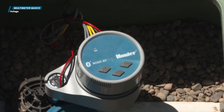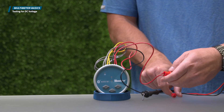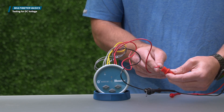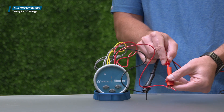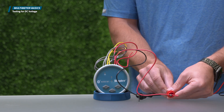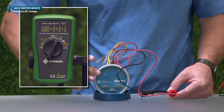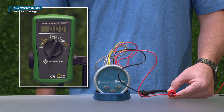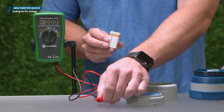When you're dealing with DC voltage, such as the one used by our battery-operated controllers, you'll need to set your voltmeter to read for volts DC. DC voltage is simply a pulse, so when you test for DC voltage, make sure you have the common wire touching the black probe and the station wire touching the red probe. When you turn on a station from the controller, you will only see a quick reading at the voltmeter. This setting can also be used to test batteries in general.